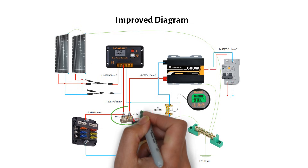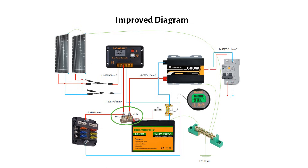I'm adding a 30-amp fuse for the charge controller and a 75-amp fuse for the inverter. This significantly improves system safety. The fuse I'm using is a marine-rated battery fuse, or MRBF, mounted on the main battery terminal.